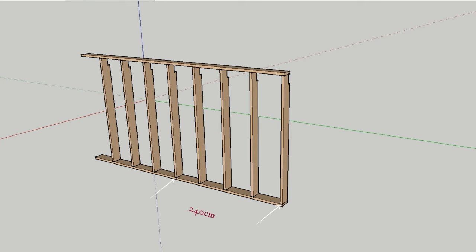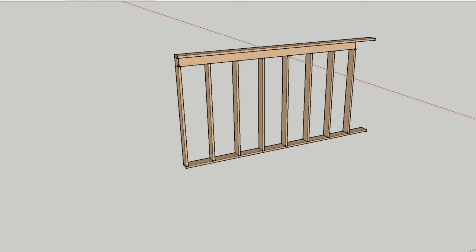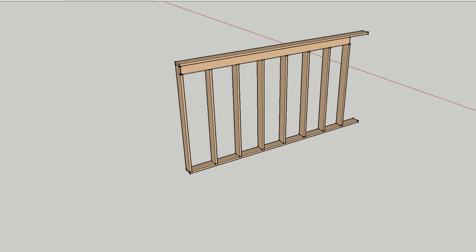The construction industry has adapted its material for these dimensions. If we are going to attach a header band, I want it to be supported by all the studs even at the joint. I therefore buy timber that is CC adapted — in this case a joist that is 240 centimeters long. As you can see, the joist ends up centered between the first and last stud.